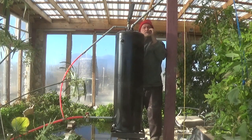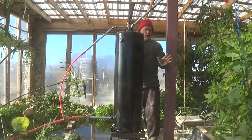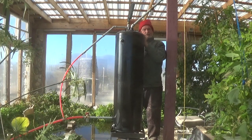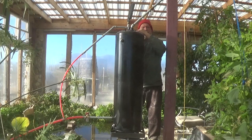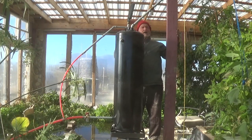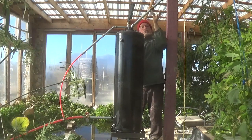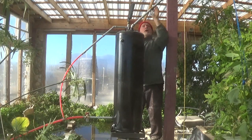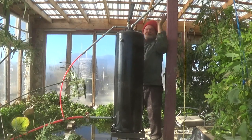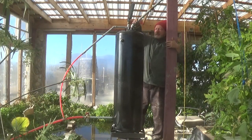This is an off-grid greenhouse. The whole idea is to use as little electricity as possible and as little propane as possible. We can't help the propane use right here when this is operating, but we can make it so we don't have to operate this so much — that's the next video. Since it's an off-grid system, I had to tap into water that would flow in here on its own without a separate pump. That was easy — I've already got the pump bringing water up to the float bed, so I just tapped into that and let gravity bring it down here. I've got a valve here to control how fast the water fills the tank. I can either fill the tank all the way up, shut it off, and leave it with 40 gallons, or I can have it trickling in. It trickles in at one end, fills up to 40 gallons.